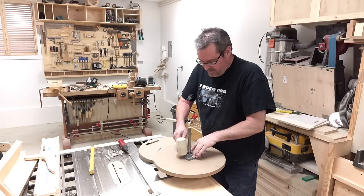One way to keep these bearing blocks in place so that they don't move side to side is to make plywood rings that go around and fit tight to them. I'm going to go with construction adhesive, put right into the corners here like this, and that should do the same thing. This stuff sets up really hard. And when I'm finished using the machine, I can always chip this right off. It should come right off fairly easily. Let's put that in and then smooth it out with my thumb.